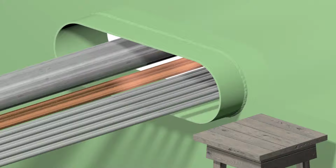The pipes have to be cleaned at the spot where the sealant is applied at a later stage. This means 20 mm at both sides of the transit. If feasible, it is of course easier to clean the pipes more than the full length inside the transit.